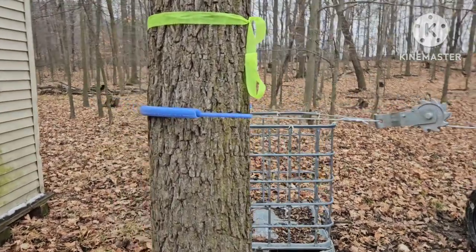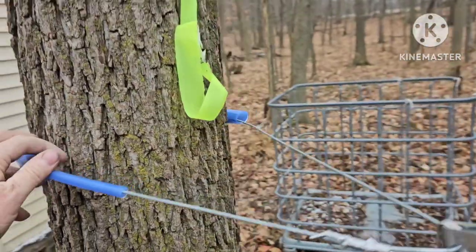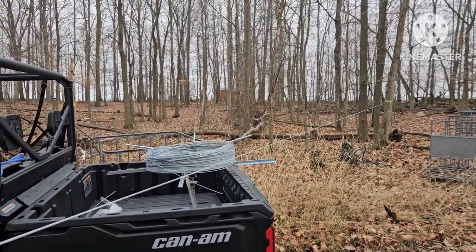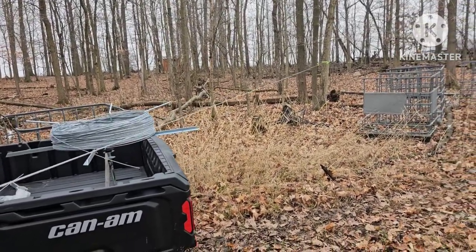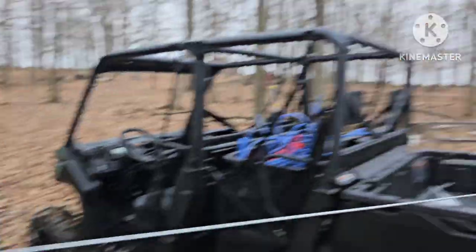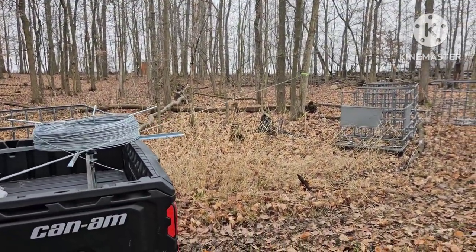Five-sixteenths tubing, three-quarter tubing around the tree. I ended up putting a tightener on each side, especially on the long run - I noticed it was really nice and taut about halfway and then started getting loose. So I ended up taking the end off and putting another tightener up there and it worked out really nice.